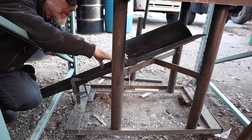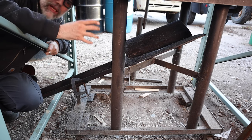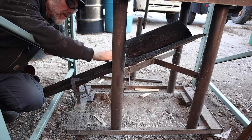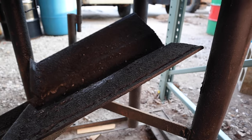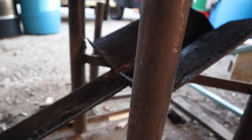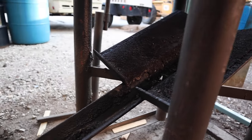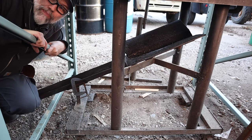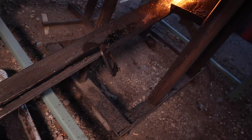The trough on the bottom is actually pretty straightforward. I originally started off with just a piece of angle iron. Even though I had that hole right in the center of the kiln with the wax just dropping a foot or so — 14 inches — before hitting the trough, it was still with just a little bit of wind or breeze, I was getting too much splatter and too much was actually missing the three-inch angle iron. So I went ahead and added these wings to give myself a larger target area that allows the wax to hit and flow towards the middle, and then created a little lip at the bottom to keep the wax flowing towards the middle so it can travel smoothly down the trough and into my baking pans where I'm capturing the wax.